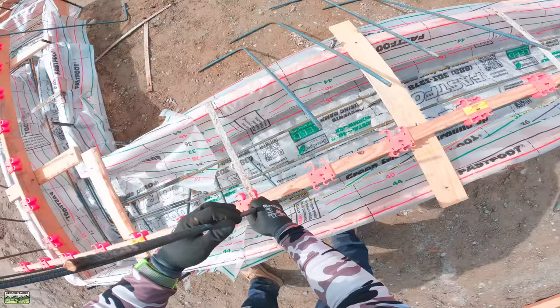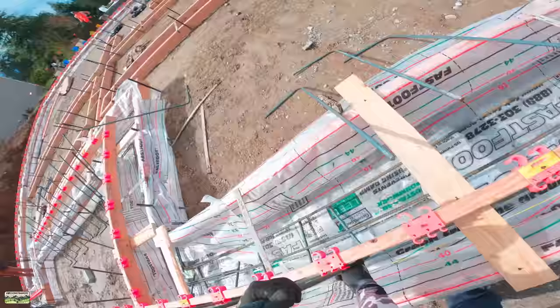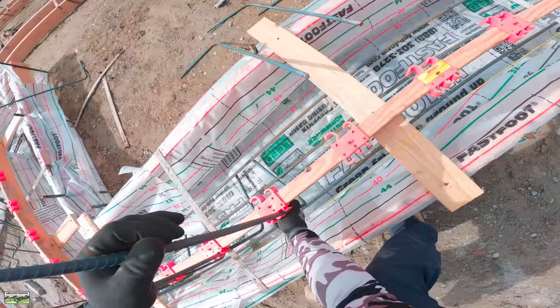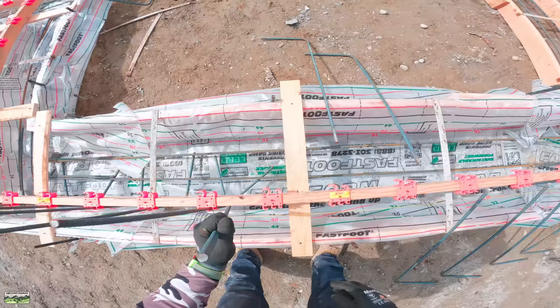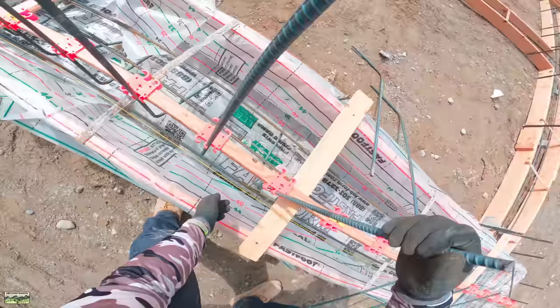This was our first time using Steel Mate - I'll put a link in the description. These things are awesome - they're reusable. Lay them out, tack them to your 2x4 on your spacing, 10 inches for us. Later when we strip it, we'll leave all of those little orange Steel Mates on those boards so we don't have to lay out again. Installing these verts was so fast - our first time, we got it down to 190 in an hour with three guys, and we're just going to keep getting faster.